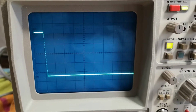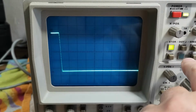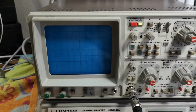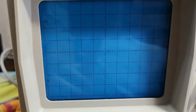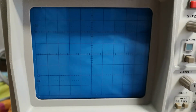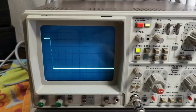So now this is a pulse that's about 10 microseconds. I intentionally made it super slow on the fall time, so you can see the dots, and then we can play with the joining mode. So this signal is more or less impossible to see on an analog scope. Let's try and go in analog mode and see if we can crank up the brightness, and then we'll see if there's anything visible. Yeah, I think you could actually maybe see this if we turn off all the light, and if we're really patient, we could maybe see the signal. But yeah, hey, this is exactly why digital scopes are winning, right?